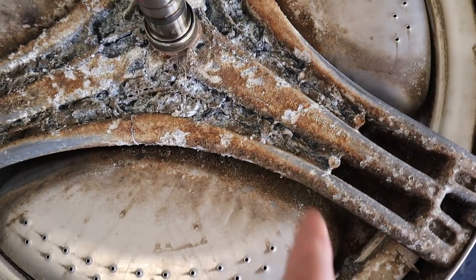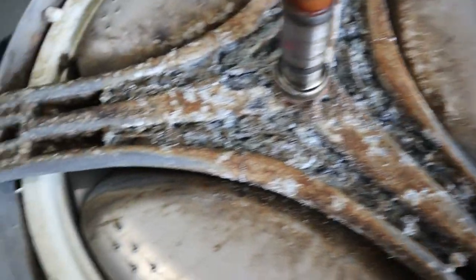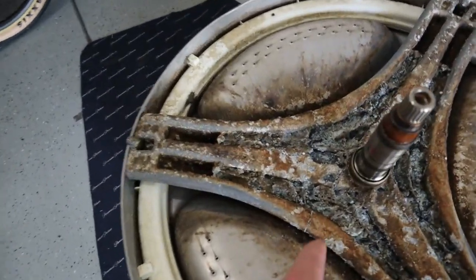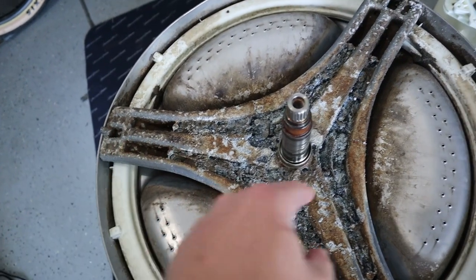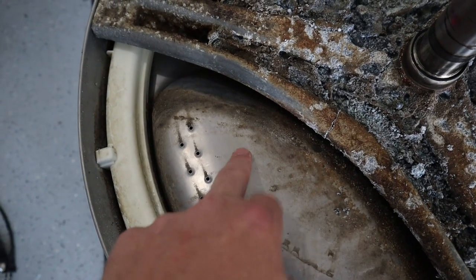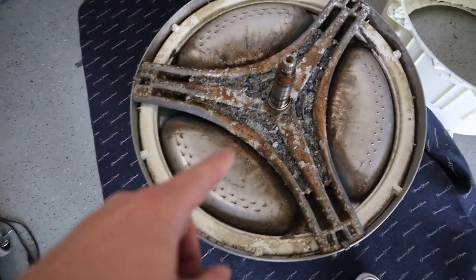This is the actual basket, and you can notice it is cracked and corroded beyond belief — cracked here, cracked here, cracked pretty much everywhere, and corroded too. All this stuff you're seeing inside that filter is just falling through and clogging it up. This is an engineering decision where somebody put a metal that didn't react well with a different type of metal, so it corroded beyond belief.